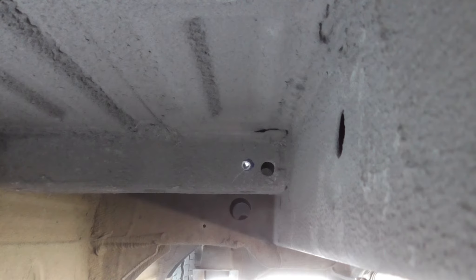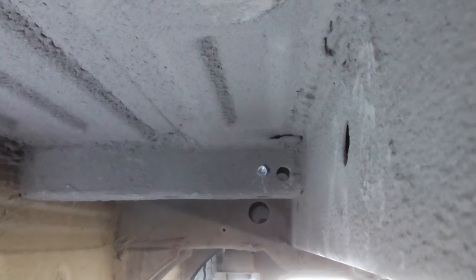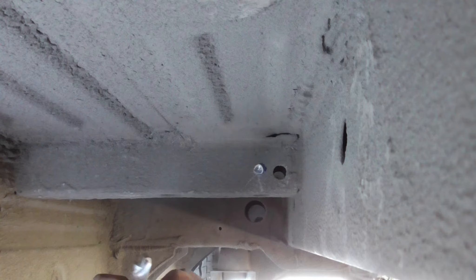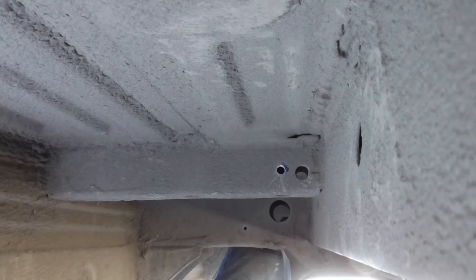The hole you want is 12 millimetres, but I didn't want to go straight in with a 12mil — this is an 11mil — but it's still touching it all the way through.